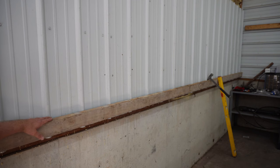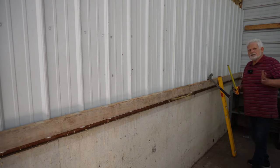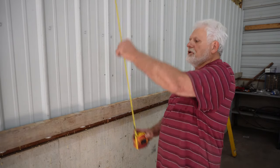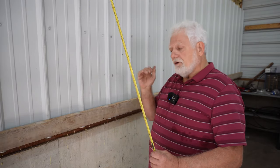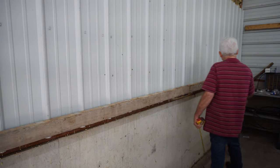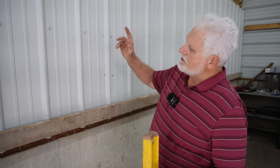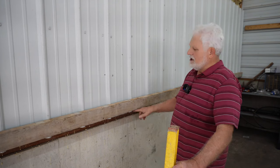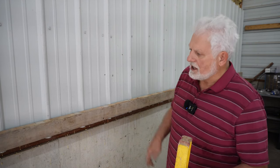The first thing in building shelves is you have to get a straight line and then a board installed to hold the back of your shelf. The way I did this is I took a tape measure — you can do this several ways. You can measure from your ceiling down because that's straight, or if the floor is level, you can measure up from the floor. I have a four-foot level here, and I measured up from the top of this concrete ledge to the bottom of the board, then took a chalk line and made a line.